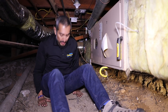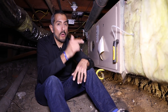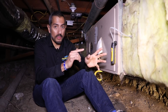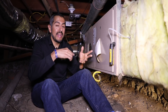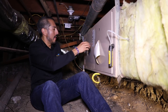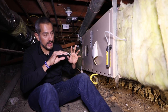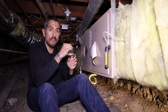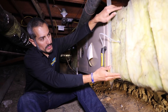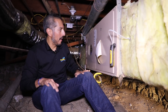One thing you always want to make sure of is that before you drill a hole you're not going to damage any component on the inside. As prep, I removed these covers and did a visual inspection to see where I'm going to drill my holes. This was a nice open piece of duct, so there was nothing I had to worry about here.